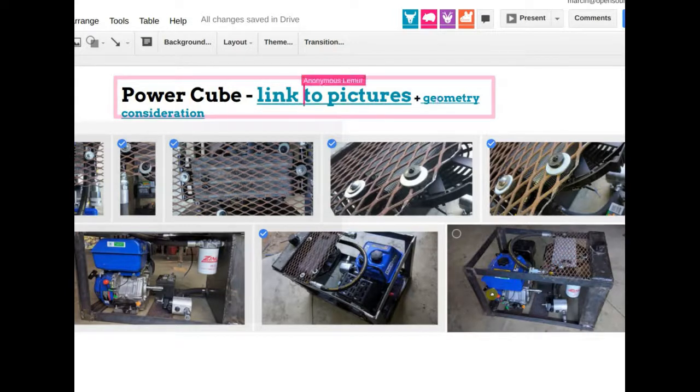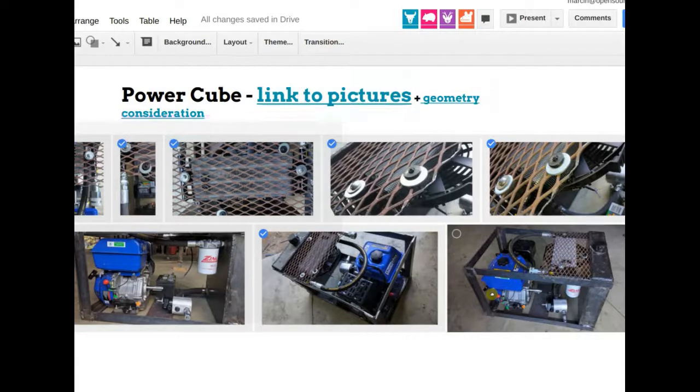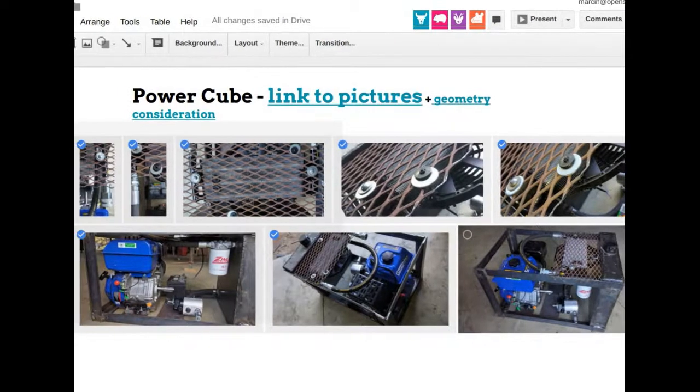The top is left open — no frame at the top — with a grate to which the fan and cooler are attached. One major fiasco on the power cube is that we don't think it has a battery charger. It's a pull-start engine, and it looks like this engine doesn't have a battery-charging wire — I couldn't find it in the instruction manual. So we might have to swap it out for the electric-start version, which absolutely has to have a charging circuit because it needs a battery to start.